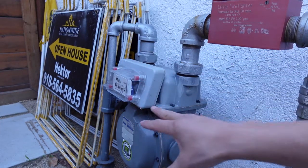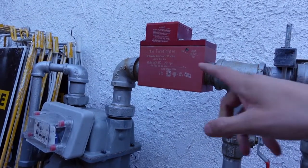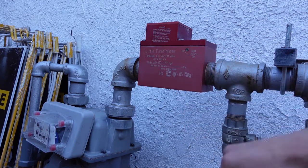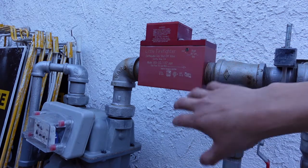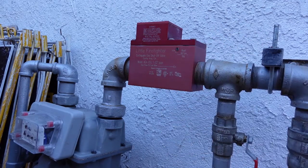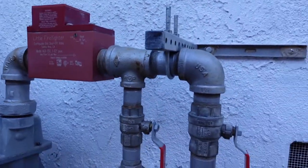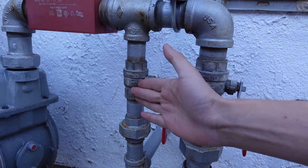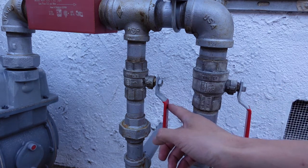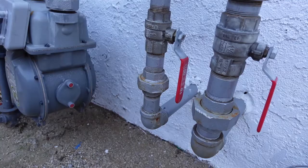This is your gas meter — call the city and they'll come hook you up with a bigger one for free. Now, in order to pass the inspections in the City of LA, you need to install a gas shutoff valve — you need one before you sell your house, and for an ADU you need one to pass inspections. My plumber installed this massive shutoff valve and the city inspector just looked at it, said it was okay, and signed off right away. Also keep in mind — you need an individual gas line for the ADU. It cannot tap into the gas line for your house; it won't pass inspection.